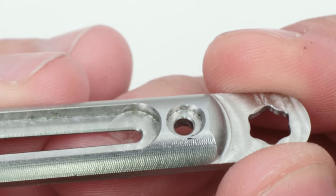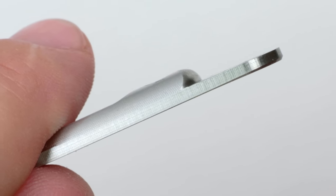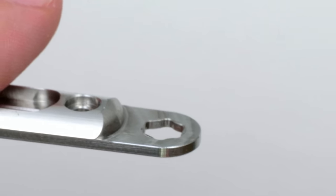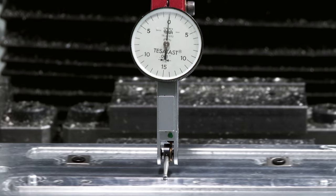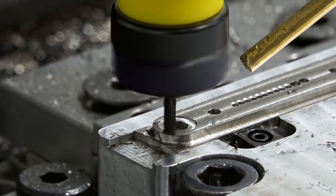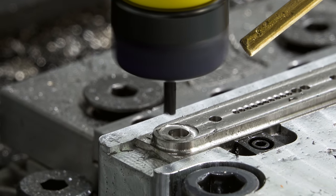Same with this hole, and this top edge is sharp. It should also be too big if things are positioned wrong, so I shifted everything back. I think I have some kind of angular problem. I thought maybe the fixture could be slanted, but it was fine — it's only happening in one area. So I thought maybe it's a problem because of the little pocket on the bottom, and did another test.